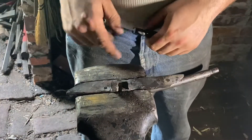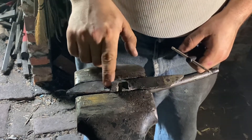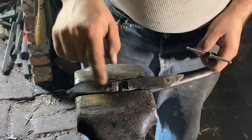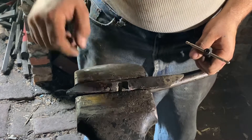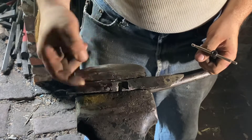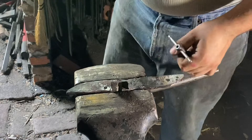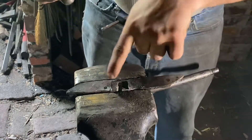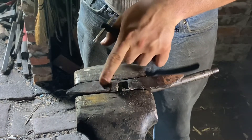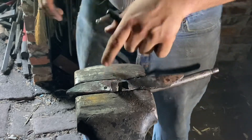Well, kids, don't do what I did — I drilled the hole in the wrong spot. I thought I saw my center punch mark but apparently it wasn't there. How I fixed that was I drilled it out to a quarter inch, then I put in a piece of rod and countersunk the edges of the hole on both sides and peened it with a small ball peen. Then to get inside I had to use a ball end punch and peen it around to that countersink, filed it flush, and then drilled on my center punch mark.